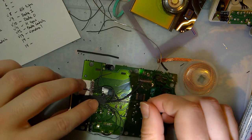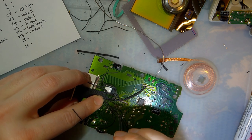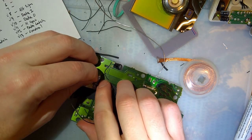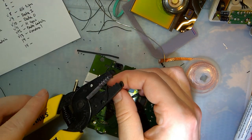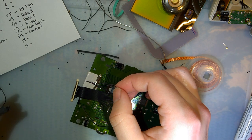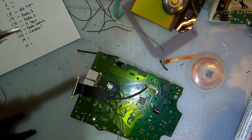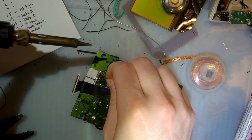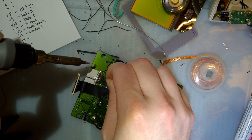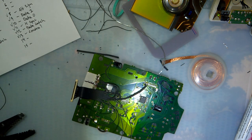Okay, next up should be H-Sync, which goes to pin 17, so right next to that again. And I'm trying to lengthen these wires so that they can all lay flat without crossing over. Probably missed that mark, but oh well. What did I say? Pin 17 right there. Boom. Or at least without crossing over too many times.